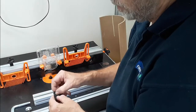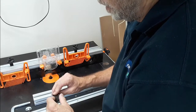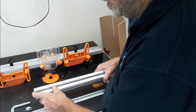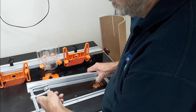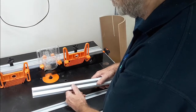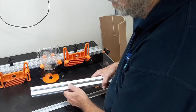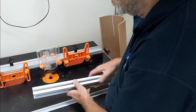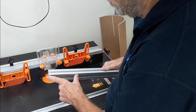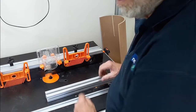So there are two options: you can either trim out the end cap, which is a perfectly valid way of doing it. But it was suggested — I think by Man of Wood — that you can route out that first section. Because aluminium is relatively soft, you can use normal woodworking bits, or alternatively go to a metal cutting tip router bit. I've got a standard timber one in there, so we'll see how we get on. I've got a featherboard set up to keep it down and a stop on it to stop it at the right distance.